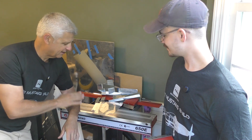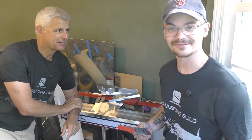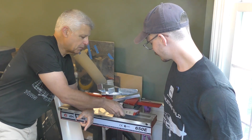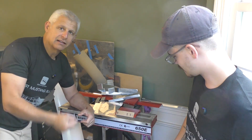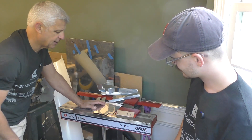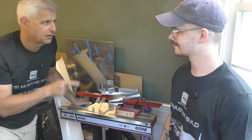Let's start by telling everybody what this is. You guys at home probably haven't seen this in years since we did some parts on it, but this is an electromagnetic brake. You ever used one of these before? I've never seen one — I didn't even know these existed. When we put a piece on top of these heavy steel parts, we can hold any part, and when we turn it on it actually clamps it down and then the braking process starts. There's a foot switch that Brayden's going to use, and also a micro switch that does not engage until you start to pull the lever up. Brayden is going to turn this part into a full finished part.